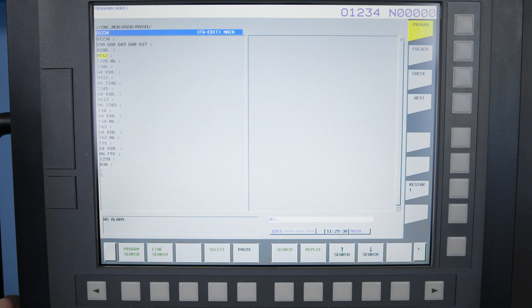Let me show you an example of my program. As you can see, when the M112 is commanded and the M6 is executed, our ATC arm rotates slower to avoid the arm losing grip on the tool due to the speed of the rotation. A couple of codes added to your tool change — one coming from the magazine and going into the spindle, and another coming out of the spindle and going back to the magazine — and now you have full control of that tool that is heavier than your standard tools.